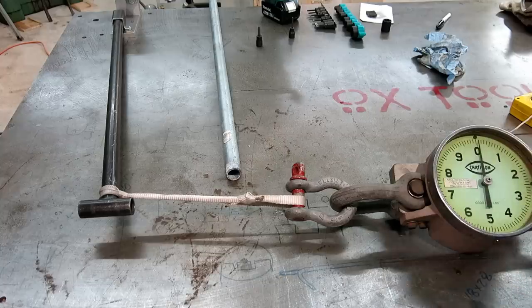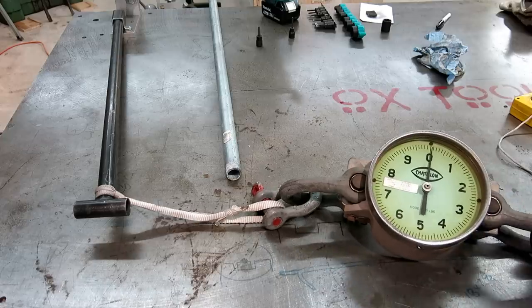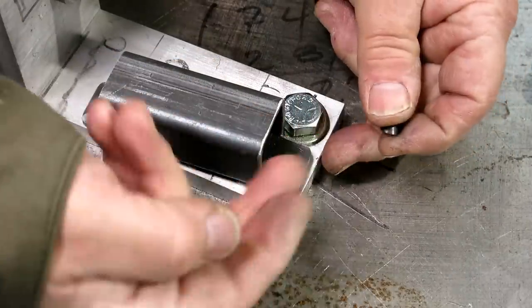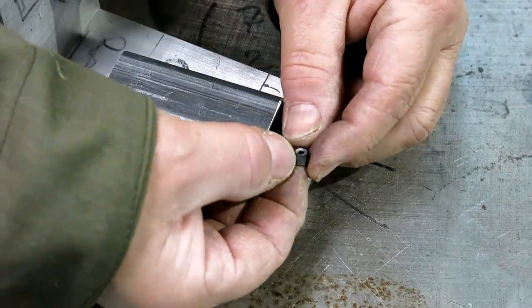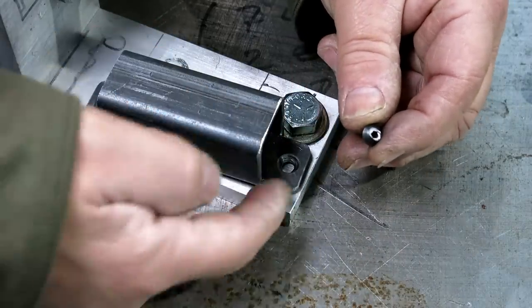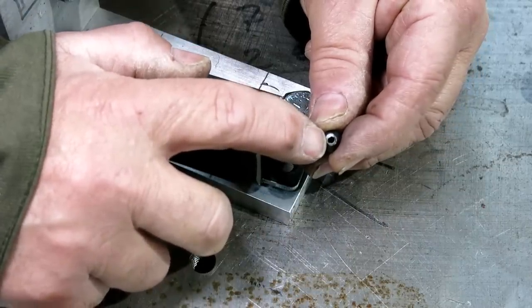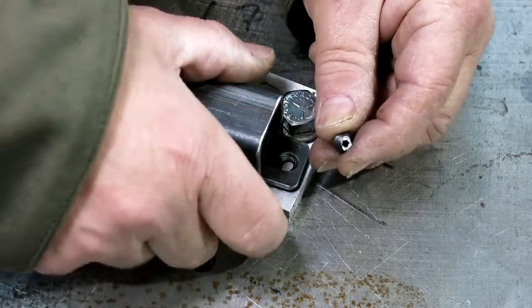Let's go see what happened, because that's always exciting when you get a result, right? Cool. I think one of the fasteners went. So this fastener sheared off, and then it rotated, which sort of makes sense. It's interesting how that sheared, though. Take a look at that. The line where it's shearing, because this material is so thin, it happens to be probably at a pretty unfavorable spot there, where there's very little cross-sectional area, right?